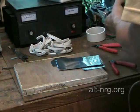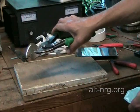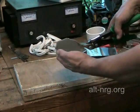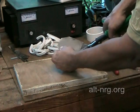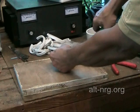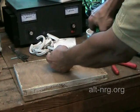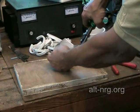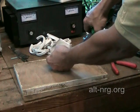Since I don't have the ability to stamp these out, I'm using what you'd call duckbill sheet metal shears. What they allow me to do is go around and make the final cut, just to the outside of my line, all the way around. This is going to produce an edge that's not exactly flat, so in the end I'm going to have to take my hammer against the anvil on my bench vise and tap these out to make sure they're perfectly flat before assembling them inside the inverted T-cell.